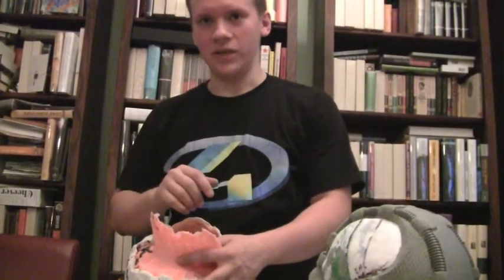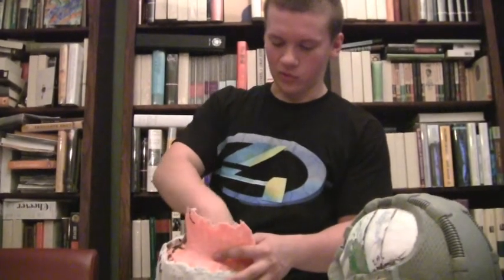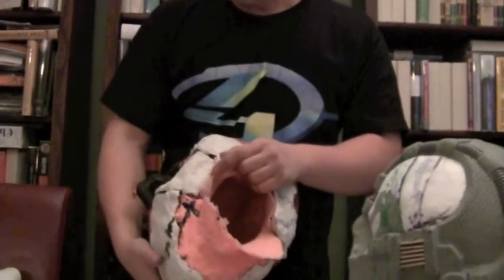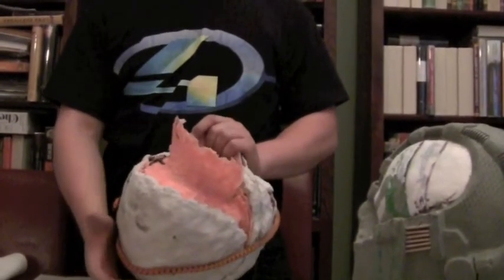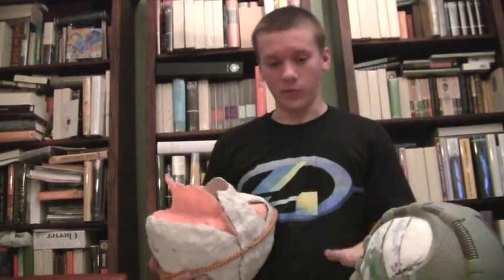Protect your eyes — that would be dangerous. Spray mold release on the Rebound — liberally everywhere inside. If you can't get into crevices, brush it on. I used Ease Release 200. I mixed together the Task 14, also two parts. This part is complicated: you have to measure it by weight. Get an electric gram scale — very important. You want to be precise with these measurements.